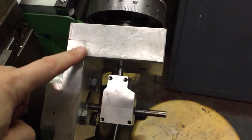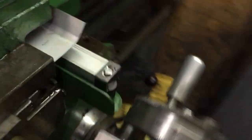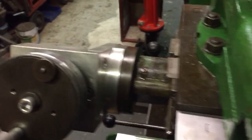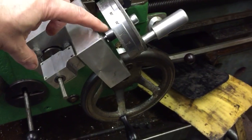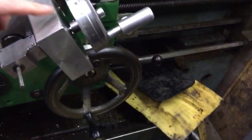I've jointed the two together with sunken Allen keys, set screws, cap head screws, whatever you fancy. This shaft needs cutting down a bit so that this is recessed down in this hole and this is nearly touching this, so that's pretty much there.